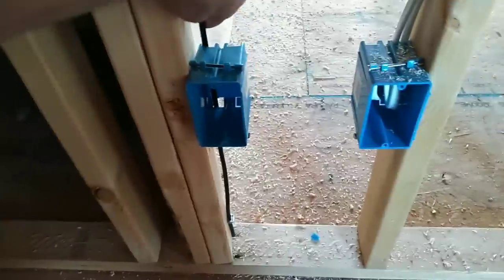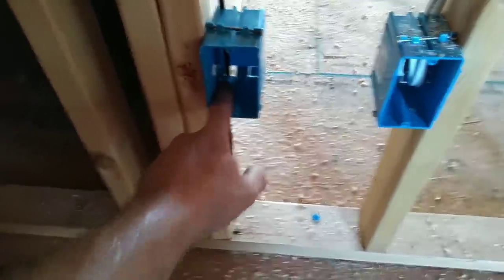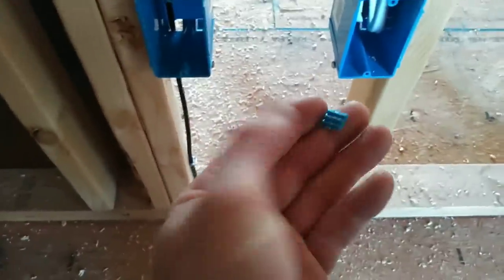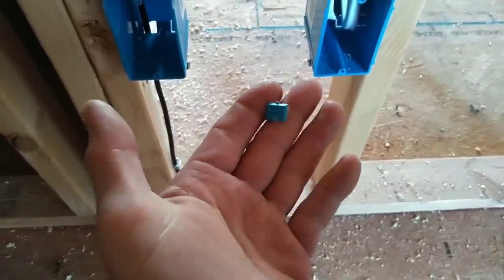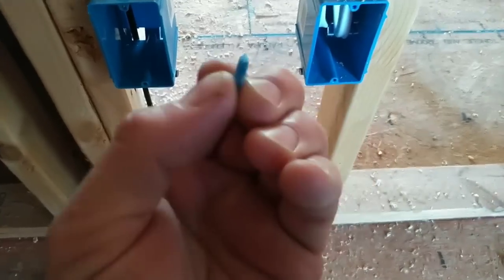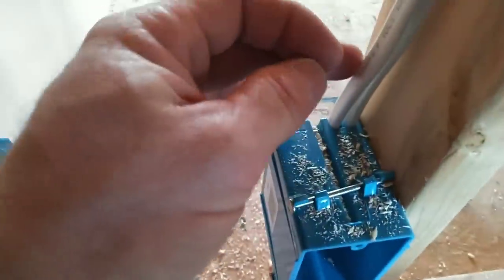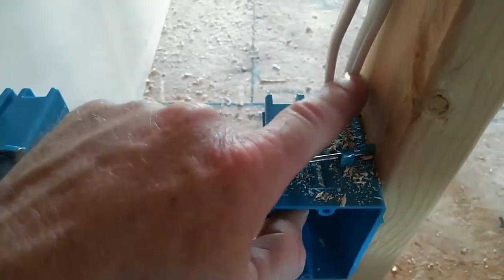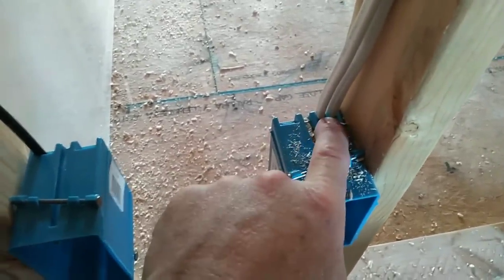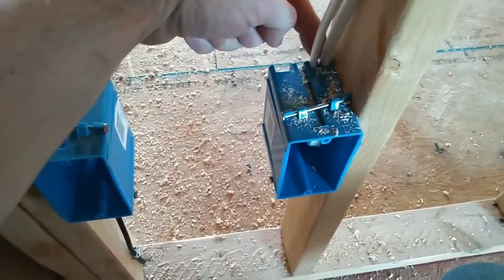One thing I want to show you: on the RG6 cable I pop the knockouts out. Some people call them knockouts but they're actually wire-holding devices. Inspectors look for these on the floor. Newer electricians and homeowners aren't always aware — it's cut on a wedge-shape angle and fairly sharp. These boxes are approved for two wires entering one hole, as long as this wire-holding device is left in place. Slide each side of your wire on either side of the device.